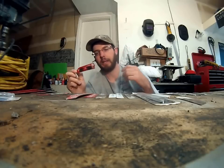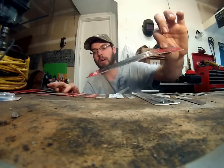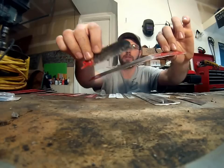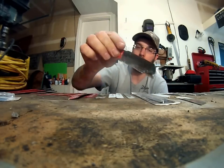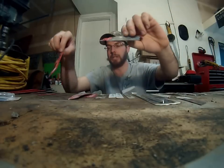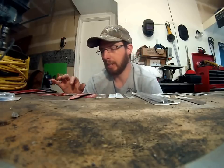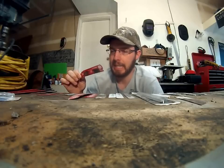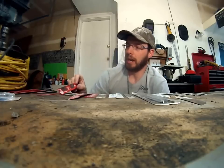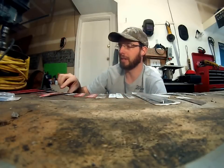The new players in the game are the carbide-tipped blades, and that's where I got to really see what happens. I wanted to see carbide versus carbide — because these are both carbide, but there's a carbide tooth and this is a carbide grit. The carbide grit was obviously very slow, and I was super impressed by the carbide-tipped blades. The only problem seemed to be that the carbide would break — that's carbide's only issue. It's extremely strong, extremely durable, super hard material, but its downfall is that it's brittle. It deals with heat better than anything else, but getting it on a product and getting it where we can use it properly seems to be the issue.